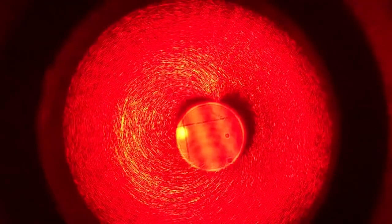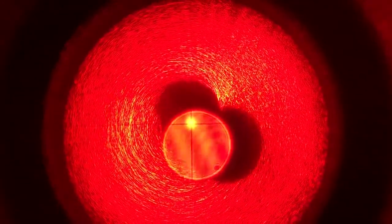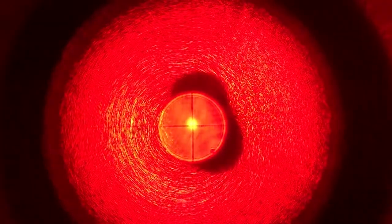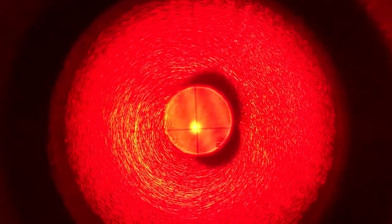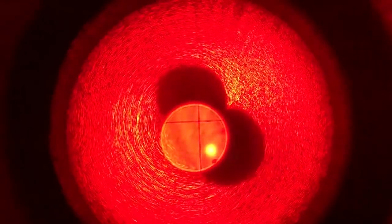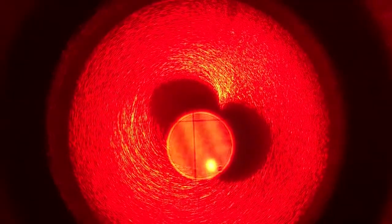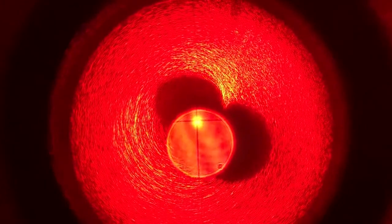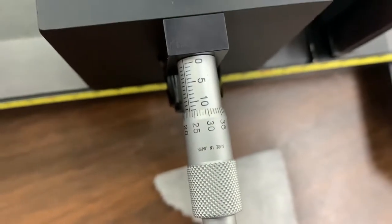Adjust the reticle just a little bit to make it square, then adjust the micrometer. When we speed the rotating mirror up, the spot is going to move — its position is going to change. Press and hold to spin it up, and once it's there, adjust the micrometer and move the spot back to where it started. Record that micrometer reading.